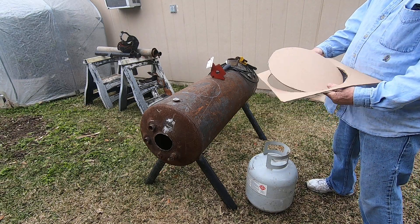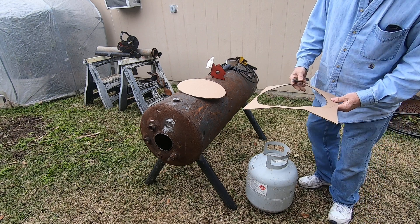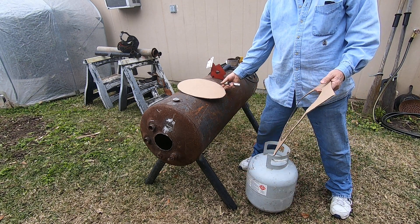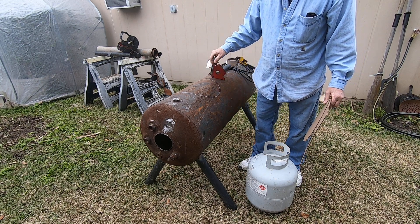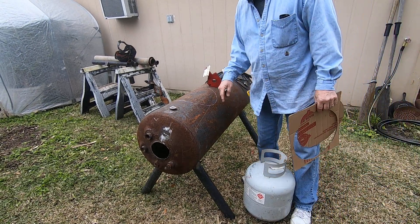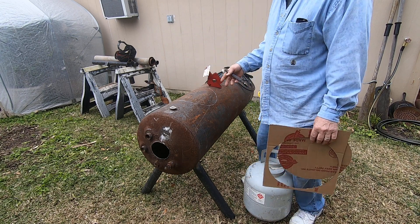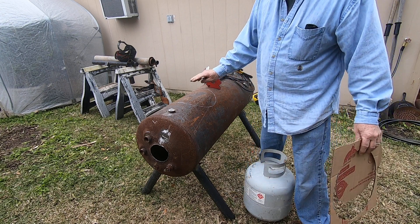You can do your math to figure out how big around your tank is — it's 12 and a quarter inches around. So you take your compass and cut your piece out for a pattern, either using that or this. If you're unsure of your math, you can take this and put it right down on the tank like this — oh, right there — so you can be sure before you cut your hole. I traced this on the outside, and I'm gonna stay on the inside of the white line, which gives me another eighth of an inch. Better to be a little tight than a little big, because this welding wire is 20 bucks a spool. I'll weld the tank in, put some boards under it to level it, or just push it down over the mud until it gets level, then level off the cooktop.